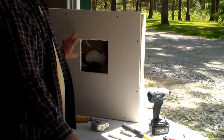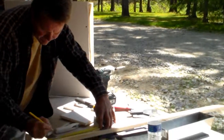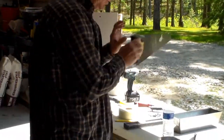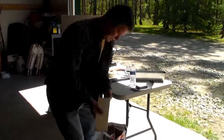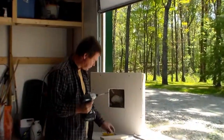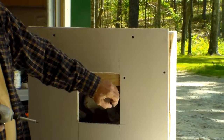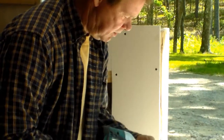So what we want to do, before we do that, we need to have some wood backer in here to back it up. Our hole's about seven inches, so we're going to cut a piece of scrap about four inches longer, giving us two inches on each side. You can cut it with a skill saw or handsaw — whatever you have available. I'm going to use my handsaw here because probably a lot of homeowners don't have a skill saw. Now that we've got both pieces cut, I'm going to take some drywall screws — I like to use inch and five-eighths coarse drywall screws. Put your backer in. When you set your screw, don't countersink it too deep; try not to break the paper, just countersink it enough to get some mud in there. Do the same thing on the bottom.